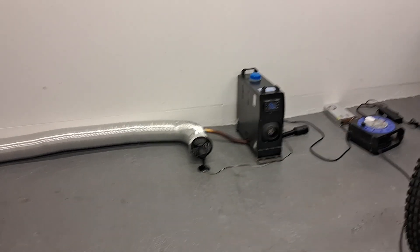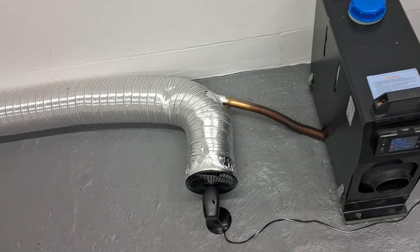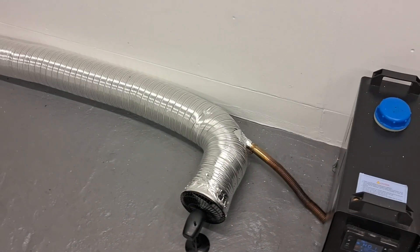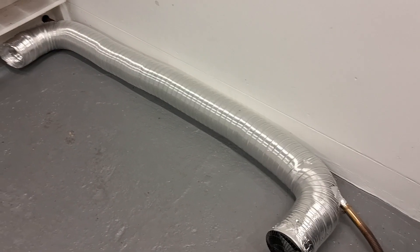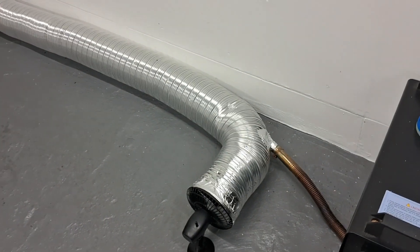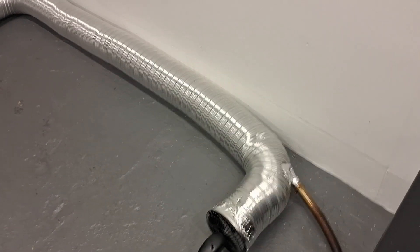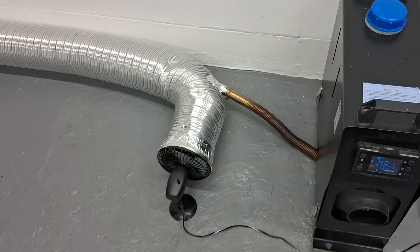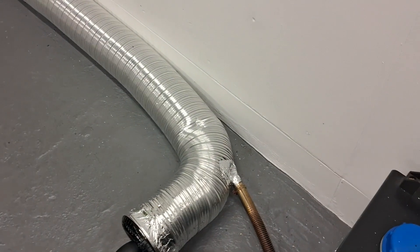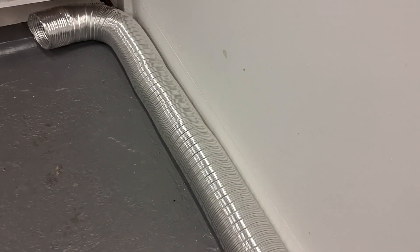I've got the heater running on the lowest setting, setting 1, which is quite adequate to heat up my double garage. The exhaust pipe is a 1 inch flexible tube with a 1.8 meter extension piece on it, going through a hole in this 5 inch aluminium ducting — this piece is a 3 meter long length. The exhaust pipe is acting as a heating element within it, and the fan is blowing all the warm air being heated up by the exhaust pipe within the aluminium ducting.